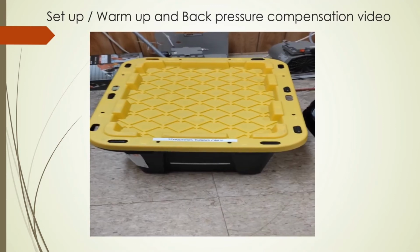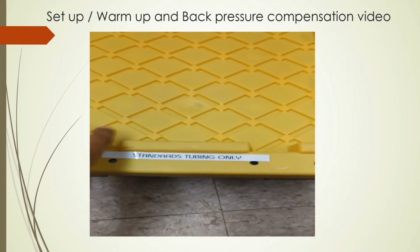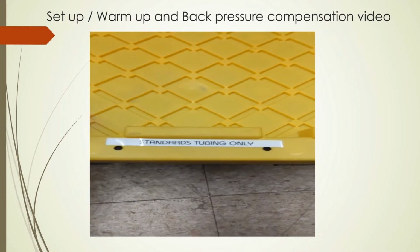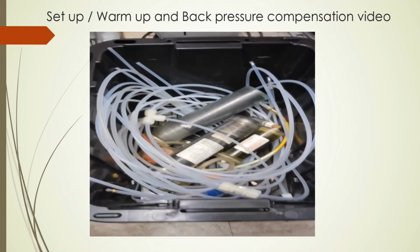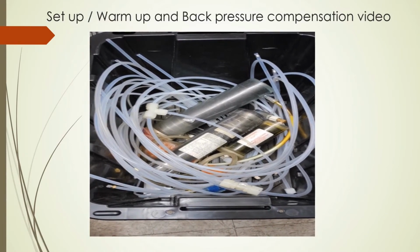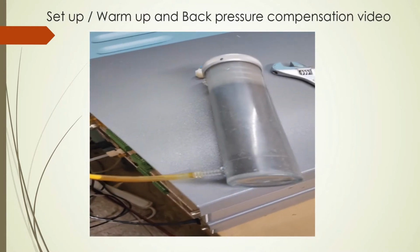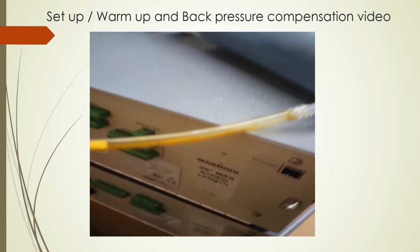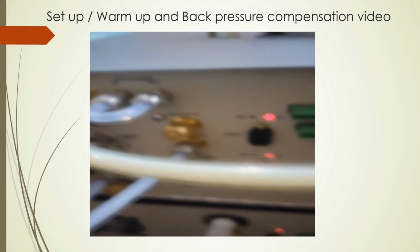We also have tubing set aside designated for calibration only. You don't want to mix in any old exhaust pump tubings into your newly conditioned and clean tubing. And we traditionally set up our calibrator unit as if it were the site nightly challenging unit, in our case a 9100 Environics. We typically use the same tubing for the diluent coming from the ZAG as well as the 9100 challenging unit to the manifold.